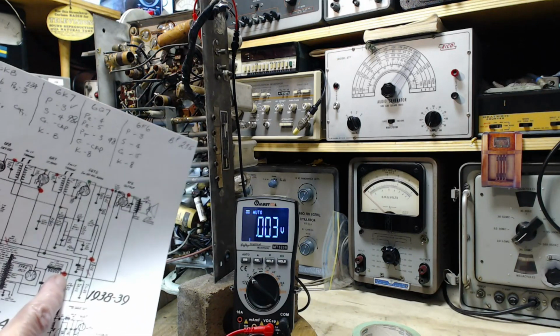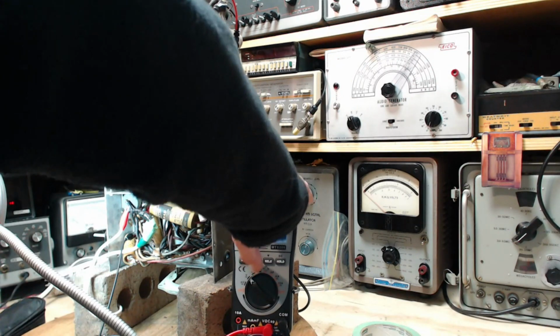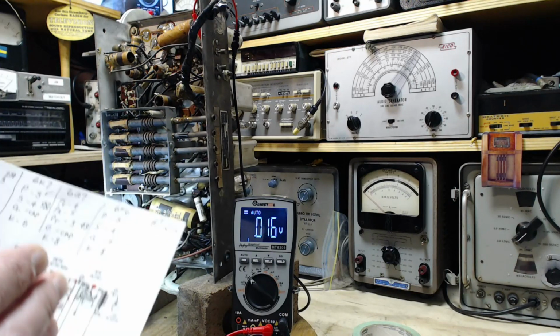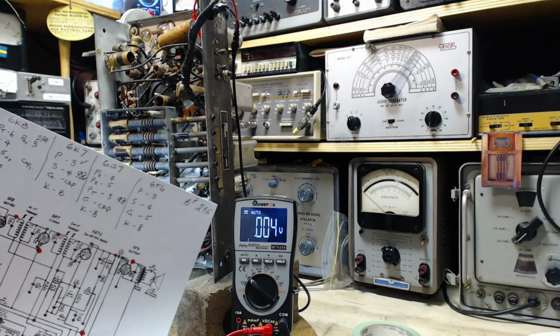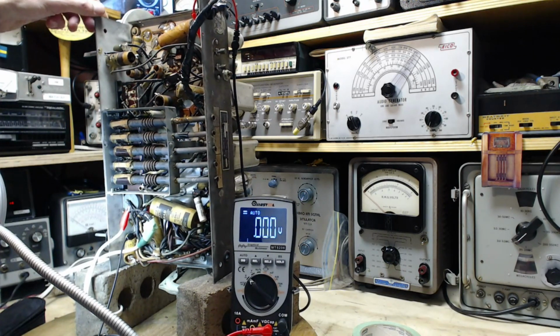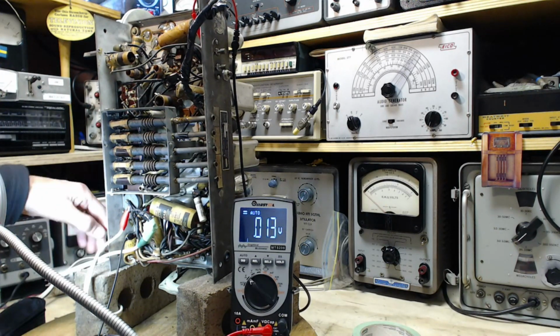After I measure it, get it on the meter, I'm going to push this relative button here, and that will subtract away that voltage from future readings. So if I manage to hit the bottom of this resistor, I got a couple in mind I'm going to check. The result of that should be 0 on the meter. Everybody got that? So what's all that static? Where'd my station go? Oh, I turned the volume down. Fix that easy. Okay.